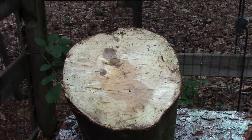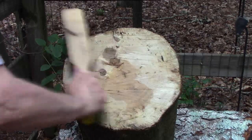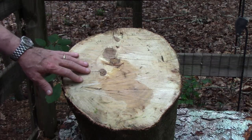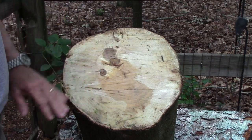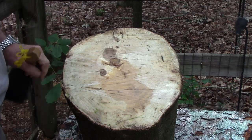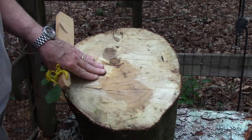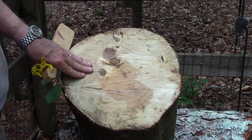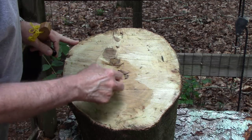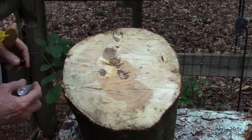Here's another piece of wood, and here's another accessory I didn't talk about. A brush sometimes helps clean the dirt and dust off. It'll help you with the chainsaw, and make it a little easier sometimes to evaluate the wood. This is a piece of box elder. It has no color in it, so it's not as desirable as some, but box elder tends to be fairly light colored, and it lends itself to dyeing. It's a fairly soft wood. Might make some nice hollow forms. So here is the center. I think it might be a possibility for me to make a platter out of it.